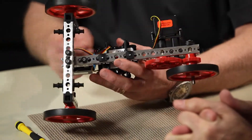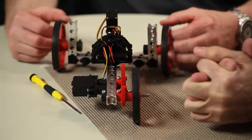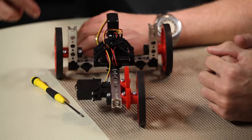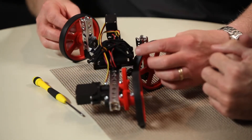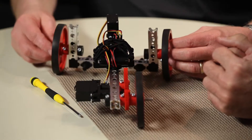From the teacher's perspective, the kids see immediate cause and effect just by simply switching those back and forth. You can also, with a little bit of work, change the pivot location back here and put a gear on it — you'll have to move your battery around a little bit, switch your motor around, and you can gear drive the steering so that instead of having direct steering it's a gear reduction. Changing the width would also impact the turning radius. The biggest trouble with turning radius is when it turns so far it hits the battery brackets and the main beam and gets a little out of balance, so you need to make sure you can maintain balance. Those are all really good learning opportunities for the teacher and the kids.